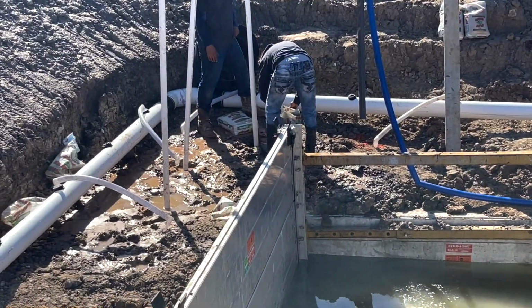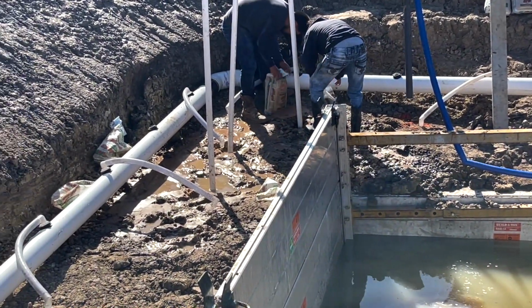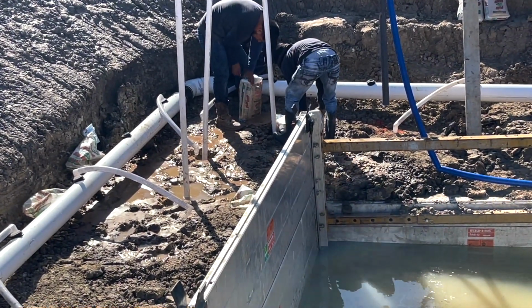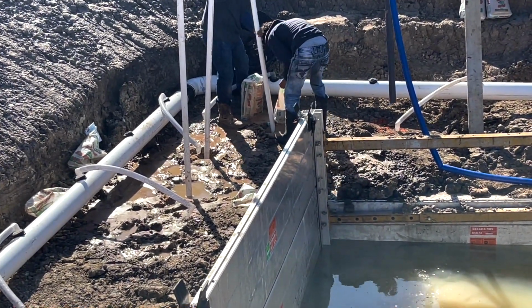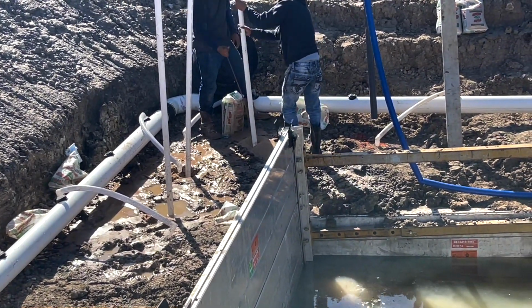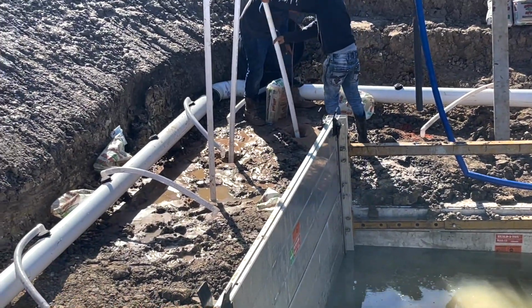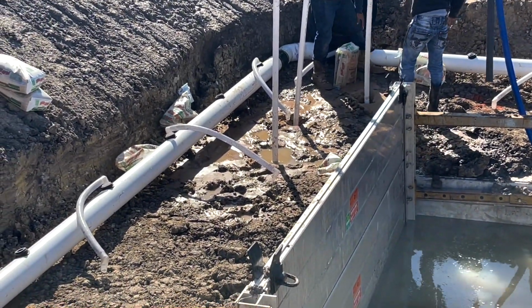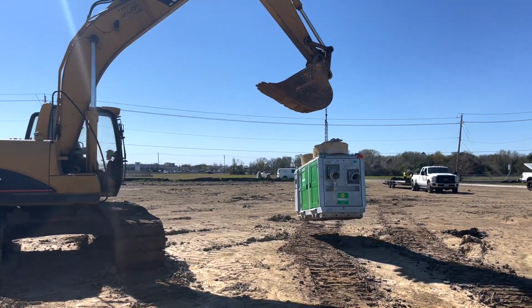When you're setting the well point, it's only the bottom 2 foot that is slitted to take in water. The rest of it's just regular 1.5 PVC Schedule 40. The sand you put in there is a heavier grain sand, and that's a filter. We use 2 bags per hole to do ours. You can use shot slag if you got access to that. That works real well.